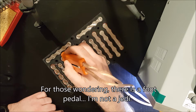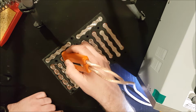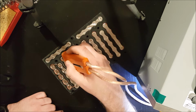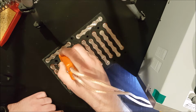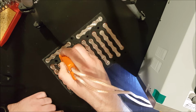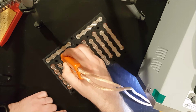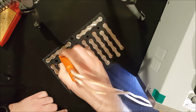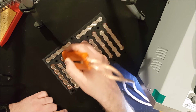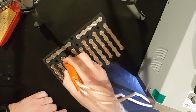I think when I'm not pushing with too much pressure, there's a little more resistance, and it's the resistance between these two probes that really creates the heat. So sometimes if you're pushing down really hard and you've got a good strong connection, you'll actually get less heat. Maybe I'm wrong about that, but that's what I found at least. So I push down, release a little, keep it on there, and that seems to be how to get the strongest welds.